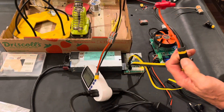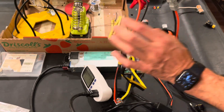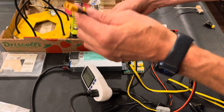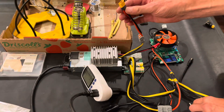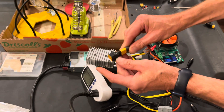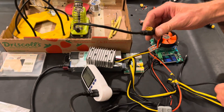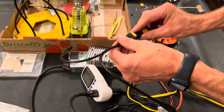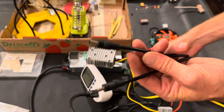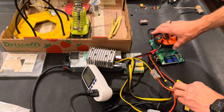On the input side, make sure you're using 12-volt input from your 12-volt PSU. On the other side you'll receive 19-volt output. Likewise, we'll use a splitter on the output side to connect two devices, so we can safely connect two KS0 miners with two cables — just like that — ready to connect to the 19-volt system. I'll quickly show you that it's a stable 19-volt output using my power tester.